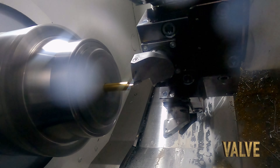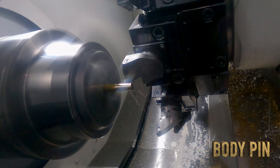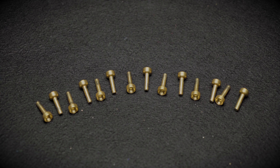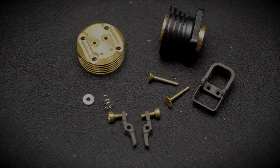Something I thought was pretty cool was the valve assembly. It was quite easy — just three components. Essentially the guide and the body, and the seat for the valve was a press-in insert that went into the head. Then the valve pops through it, then a spring, and then a little seat which sits against the top of the spring. That sits there with a little circlip retaining it at the top, which has got a groove on the back of the valve.